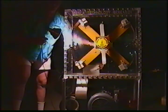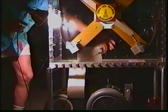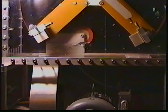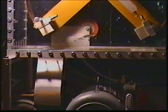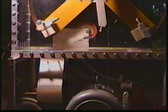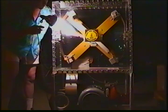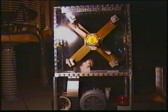That makes a full 360 degree rotation, meaning the mechanical pulse repetition rate of this rotary spark gap is 240 pulses per second. On the backside is a timing belt made of insulating material — a positive drive timing belt — so the shaft of the rotor is locked to the shaft of the motor and cannot slip. The synchronism between the motor, the charging frequency, and the mechanical position of the rotary gap makes it analogous to the way a distributor works in a car.